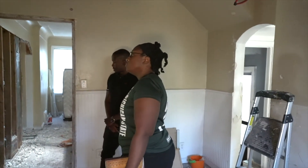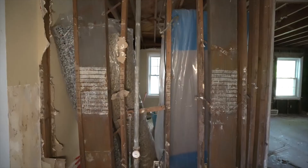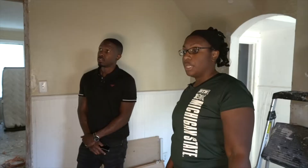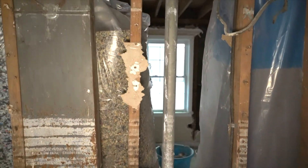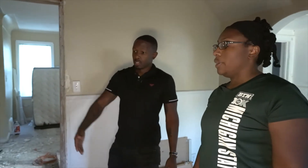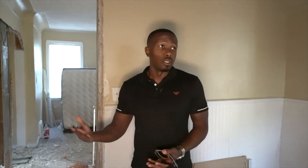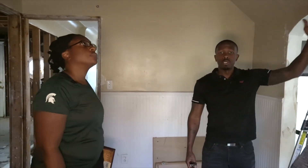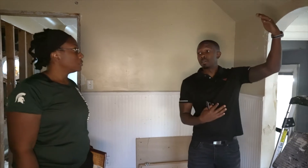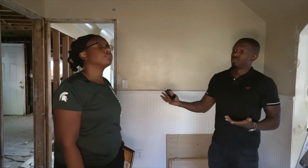If I could knock that wall down, I would. What would deter you from doing so? Well, it looks like some ductwork is going through that wall, and I don't know if it's a supporting wall or not. Partition walls often hide things — sometimes there's a box hiding electrical and plumbing. If you want 42-inch cabinets to the ceiling, you have to come in and rerun that stuff.